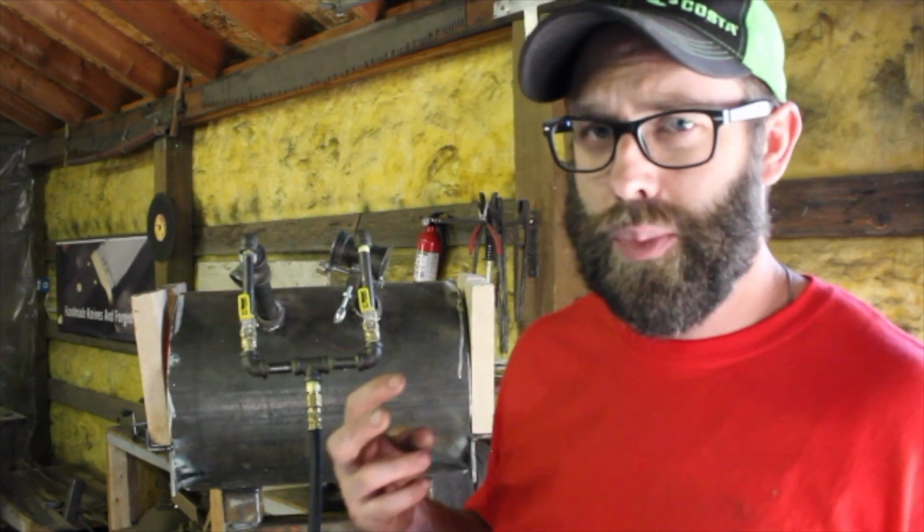Now I noticed that the ceramic insulation kind of soaks it up, so there's probably a layer about that thick that's kind of infused with it. But as far as the solid refractory, I don't think it's that thick. I'm going to go ahead and use the forge anyway, and I'm not worried about it. Worst case scenario, it breaks down my ceramic wall insulation a lot quicker than it should, and we'll deal with that. The ceramic insulation is contained, but knowing that I really could have used 2 pints of HT100 on this forge, that bumps the insulation cost up to about $150, which is fine.